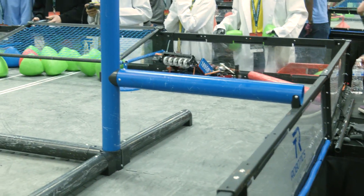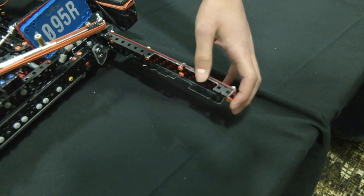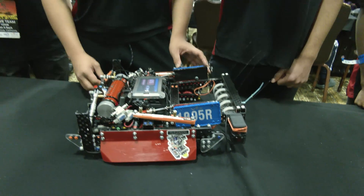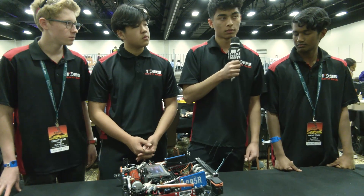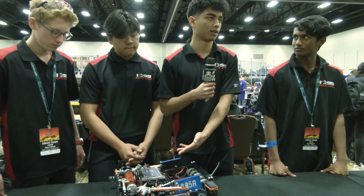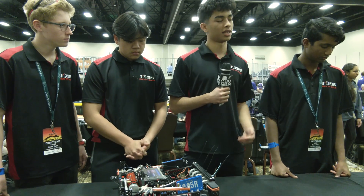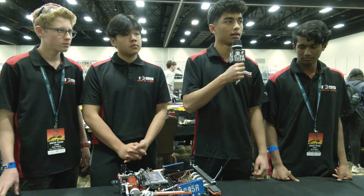Another thing: our wings, in order to fold in completely and stay as thin as possible, we have these cutouts here so they don't hit anything on our drive. They fold all the way flush in and it works perfectly. You CAD up your robot in Inventor as well. How important is it for your team to do CAD prior to manufacturing? Especially for a 6-inch bot, we think it would be almost impossible to build without CAD. You need to fit all of these things within such a small area. In CAD, what I did is make a little box that I had to fit the whole robot in, and it really helped me keep everything in check and make sure we'd meet our requirement.